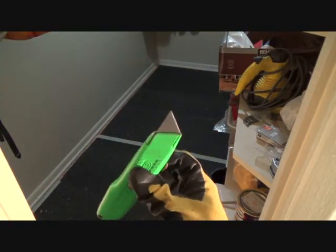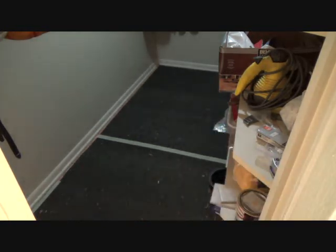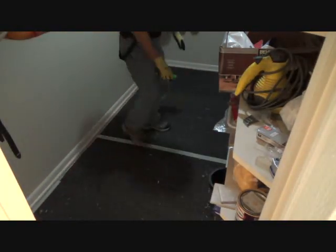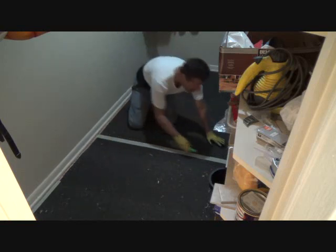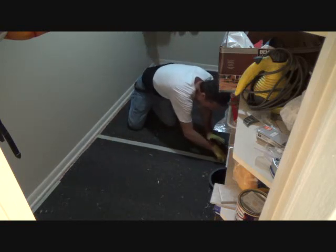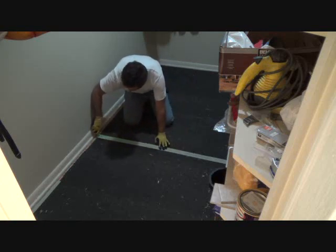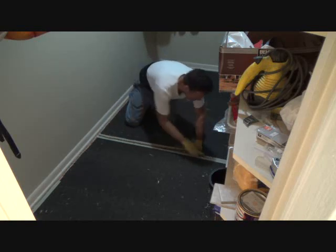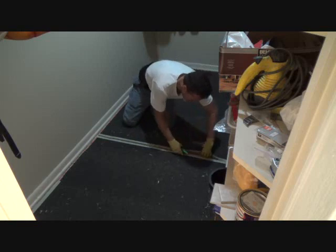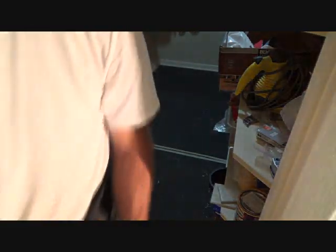That's how we're going to remove this carpet pad. The first thing I'm going to do is look where all of the taped lines are. Chances are all their seams have a line, and it's connected and attached with a piece of masking tape or something. Score that, and make sure it's up all the way. We're going to go around to all of the different rooms and do that.